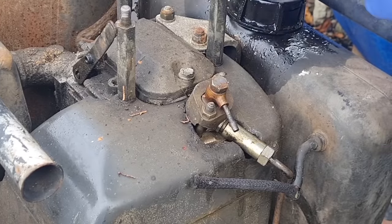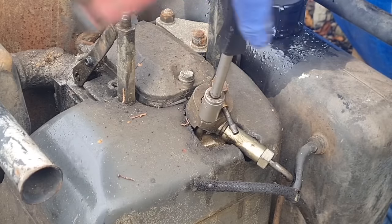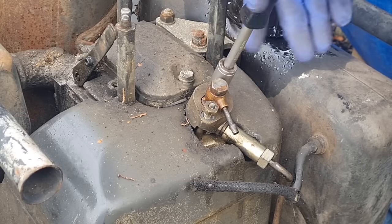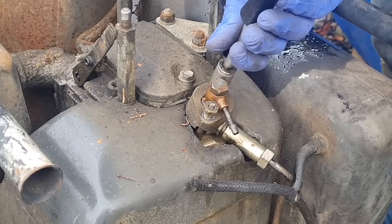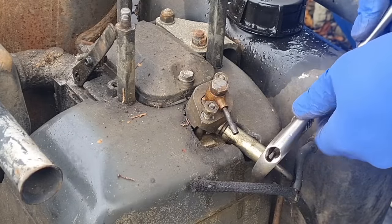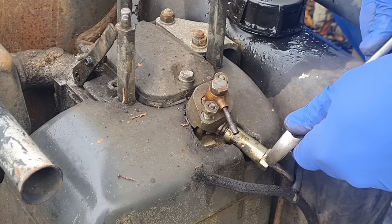So let's pop these — they're 11mm. They've been in there some years. Let's crack one side. There we go, we'll pop this injector out if it'll come. Now I'll tell you a little trick before you go taking your injector bolts out — take them out and see if the injector will actually come off. Now that's slack. We'll take this pipe off — that'll give it a little bit of stick and maybe loosen it up, because that injector could be stuck down in the head.